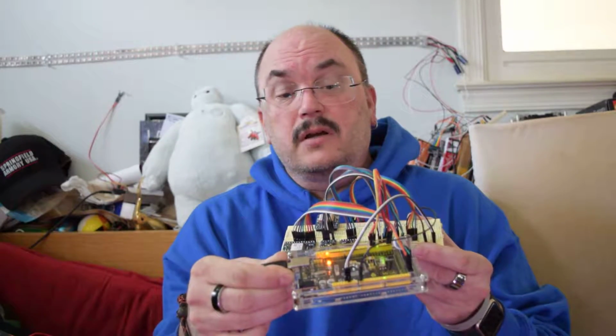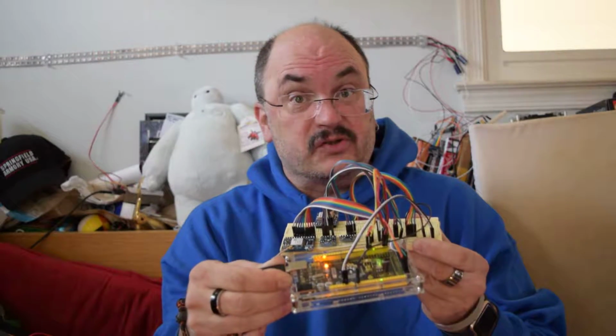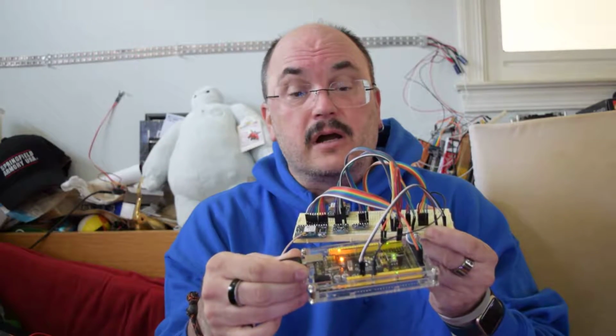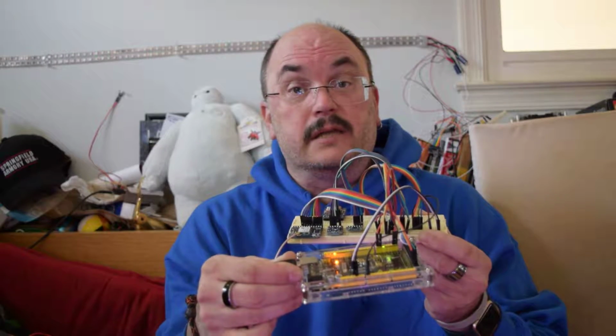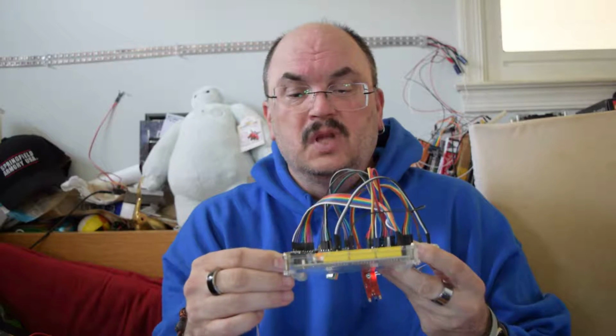is an environmental sensor running on an Arduino Mega. There are two different temperature and humidity sensors on this breadboard, and they are collecting data at the same time and logging it to an MQTT server that I have running here in the bedroom. Now the problem is that these things run for maybe 2 or 3 minutes, and then something hangs.